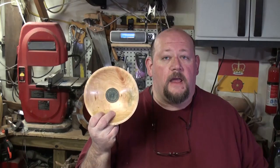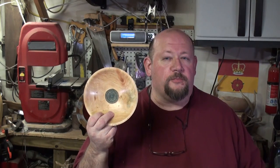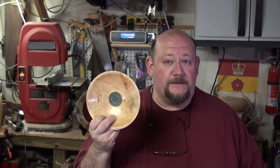Today we did gilding. We covered putting gold on the bottom of a shamrock bowl on top of dye, and we talked about adding a gold acrylic and putting an iris blue gilding wax on top of that to highlight the detail. You can use this technique on almost anything. Picture framers use it, furniture makers use it, anything that you want to highlight or add a touch of color or a richness by using one of the golds or silvers or coppers. You can do that quickly and easily